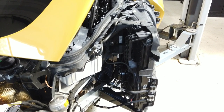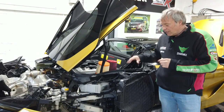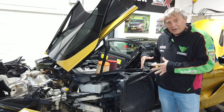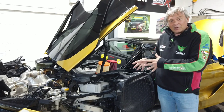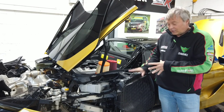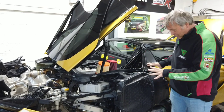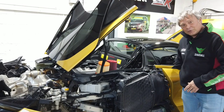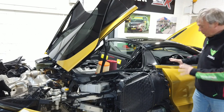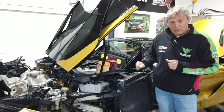There are a pair of fans back there as well, and some flaps that keep the engine warm when there's no movement of airflow over it. All the airflow from the car is being used to keep the car and water cool — a very impressive setup, and it's solid. The bodywork just sits on top, which is quite interesting. That's a huge intake, and it comes straight down from the door aperture right into the intake. What may look like a design aspect is purely about keeping the car cool.